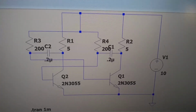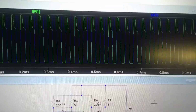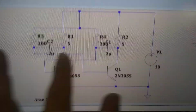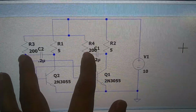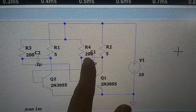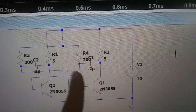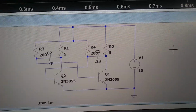Okay, so here is our circuit for our high-power oscillator, and I'm going to add in dual tunable pots between these two, so I can increase the resistance. This is at the high frequency point, and I'm going to add, I think, about an extra 10K to tune it down to the lower frequency point.